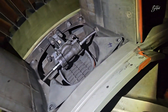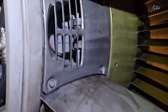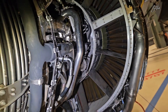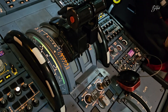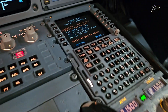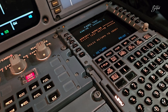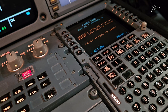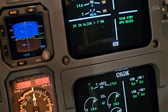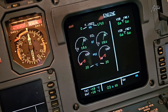After lubrication, we need to cycle the whole system from closed to open position several times. Then we can install the fan duct panels and perform the test. After this replacement we need to perform a FADEC test with engine motoring — FADEC will perform dry motoring during which it checks movement of several components like variable bleed valves, variable stator vanes, and active clearance control valves. Keep in mind the engine will spin, so you need someone near the engine to inspect the area and avoid injury or equipment damage. Safety first, as always.